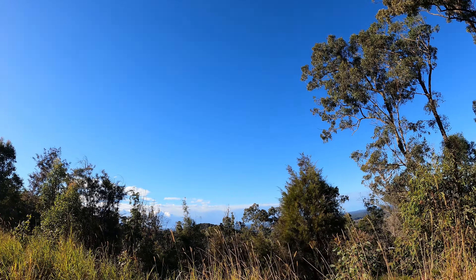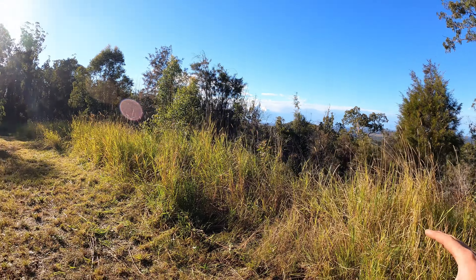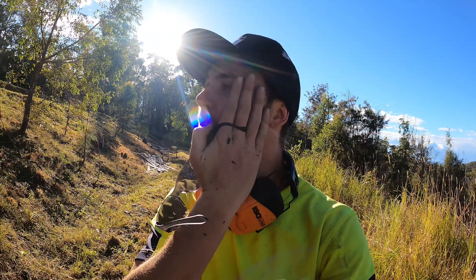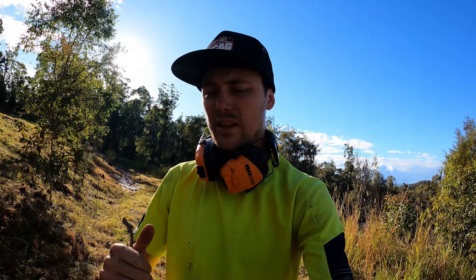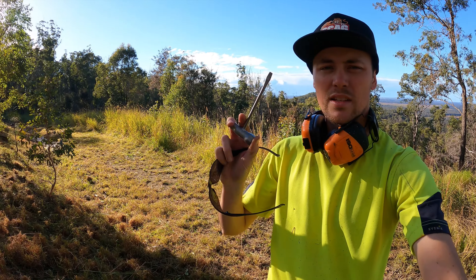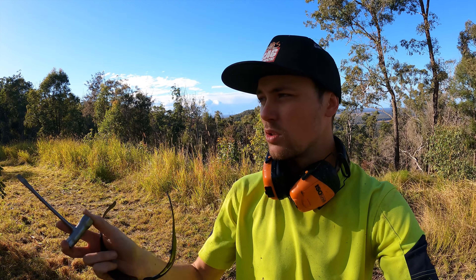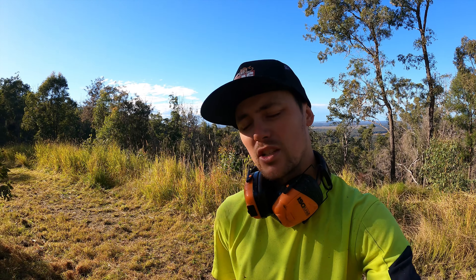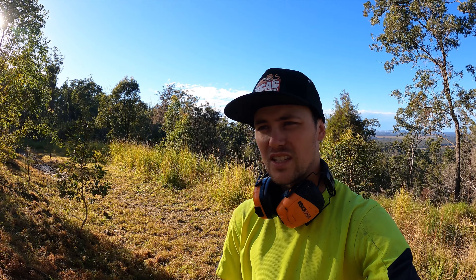Just a top view here. All this like I said we'll get sprayed. A couple of pro tips for you: bring your fuel container down with you when you're away from your ute — it's about 100 metres that way. Also bring a tool just in case you need to take your speed feeder head off, which I had to do — I hit a rock, split the cord, so I was down to just one half on the actual head. That happens pretty regularly when you're in thick stuff, hitting sticks and the cord will just snap right off on the eyelet.